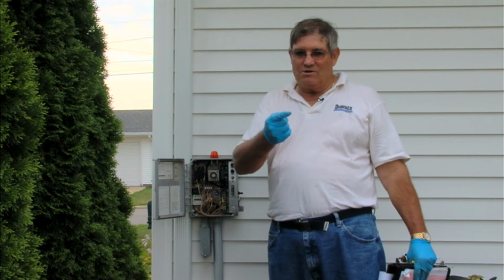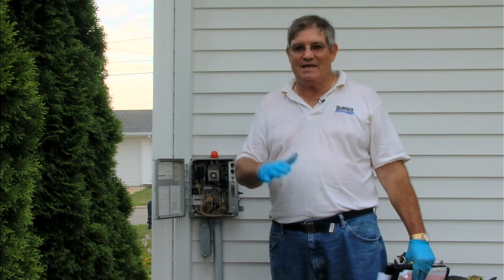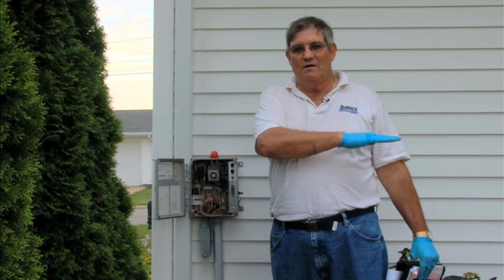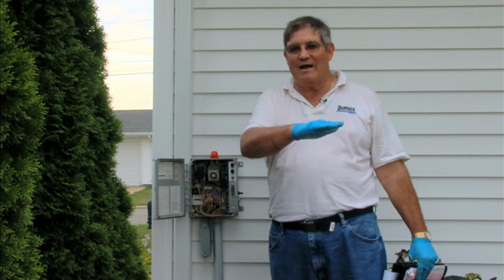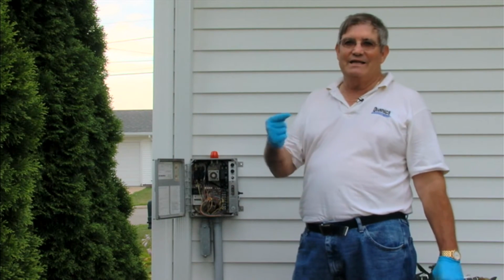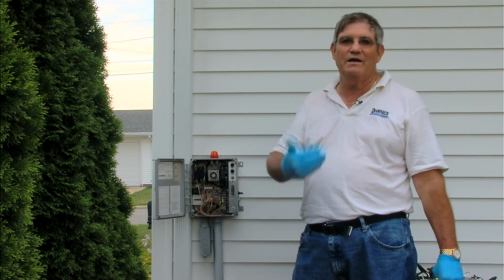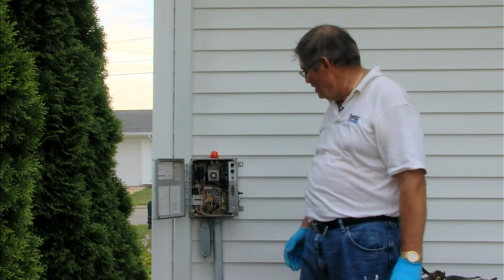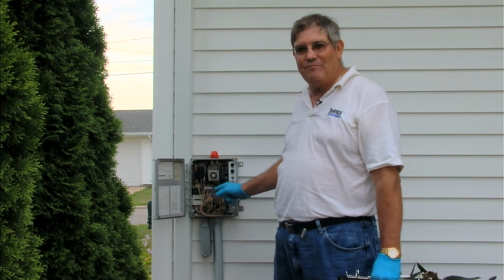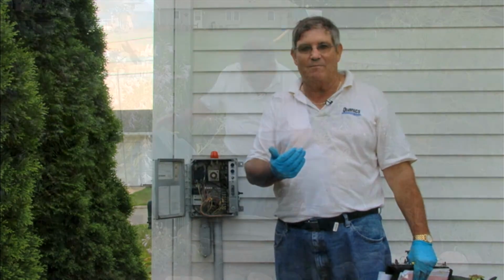One thing that you can also tell is if you're getting groundwater leaks into the septic tank. If, for instance, you're not showing any increase in the water into the house or the water out of the house, but you're seeing more water flow through the system, then it's quite likely the septic tank might be leaking, groundwater's getting into it, and you're treating groundwater in addition to the wastewater. So that's part of the value of recording these numbers every time you come out, so that you can go back and troubleshoot the system if you ever have a problem.